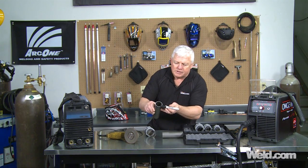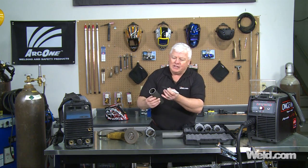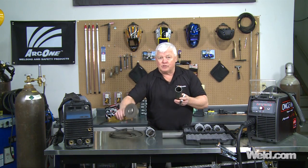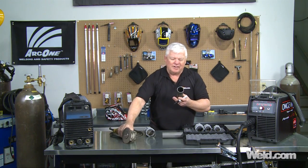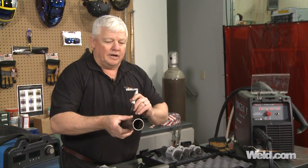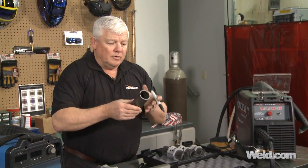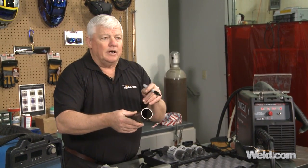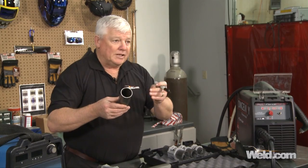This wall thickness is about 125 to 130 thousandths. You'll see this in different frames like off-road vehicles, monster trucks, and things like that. This is not going to be an easy thing to grind out. You have a choice — at home everybody possibly has an angle grinder, so you can grind it out, but it'll take forever and it's not very precise. But if you have a plasma cutter, you can plasma cut it out and then just lightly trim it up with a grinder and you're good to go. So that's exactly what we're going to do — I'm going to plasma cut it, prep it with the grinder, then weld it. Let me get all my safety gear on and we'll do plasma cutting right now.